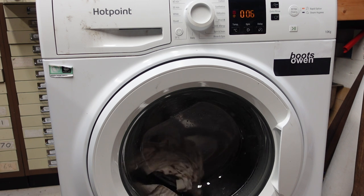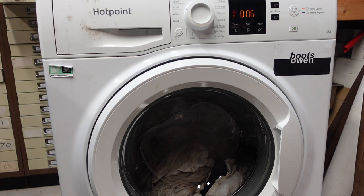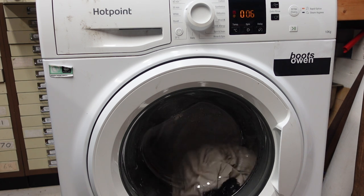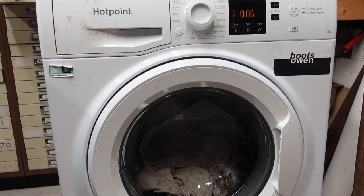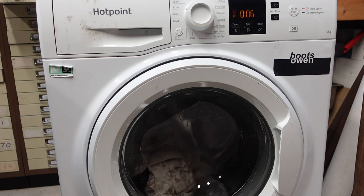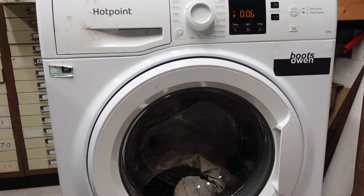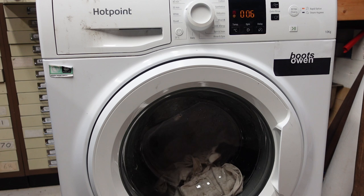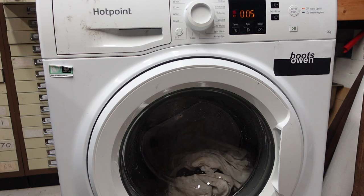I've gotten a load of solar inverters — probably too many to be reasonable, about 20 of them. I've repaired some. I've repaired the ABB Aurora — Power One type of inverter. I find them quite easy to repair because the relays tend to fail, and it's a matter of soldering them out and soldering in good ones. Likewise Solis — Ginlong Solis — they're pretty easy to repair. I've got a couple of Sunny Boys, one tested and working, another not tested yet. Solar River — I've got about three of them, two definitely working.